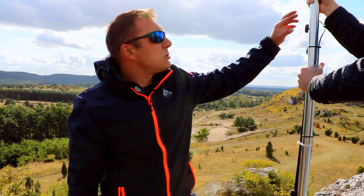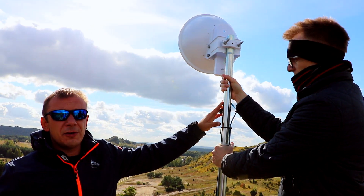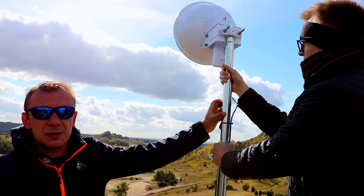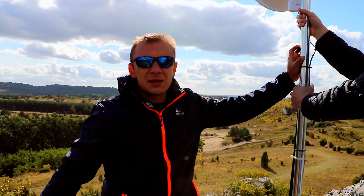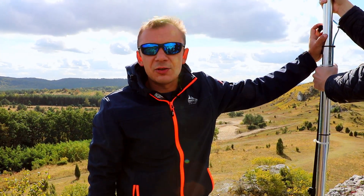Everything is tested under both TCP and UDP protocols. We'll start by testing at a channel width of 50 MHz. What's nice is that, unlike the AirFiber 5X, here we can set the channel width to 100 MHz. With that, we should be able to push around 500 Mbits in one direction. Let's get to work. The antennas are aligned. We've set the signal at minus 59, with 1024 QAM modulation. We'll see how it goes.